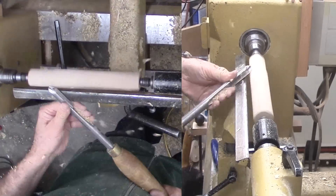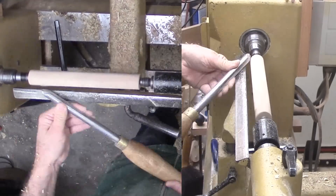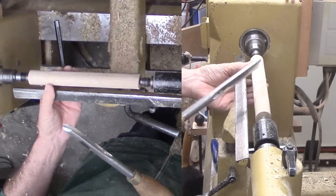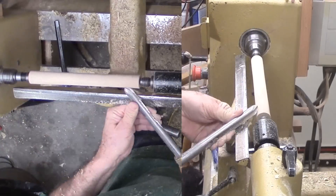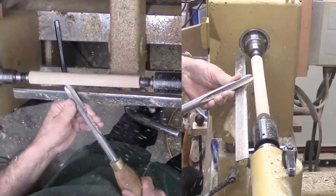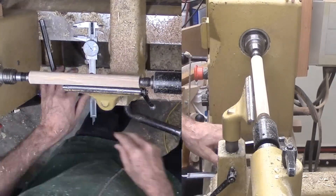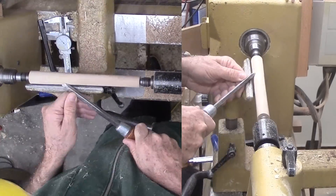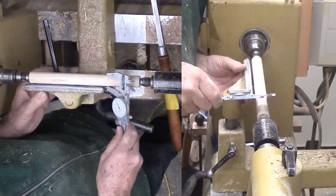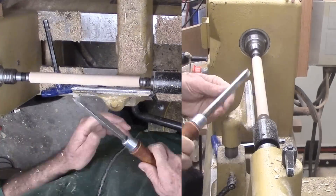Finally, I can start the heart. I am making the initial spindle longer than last time since I will be cutting it in half before hollowing it and then cutting the angle — I will not get the economy of a common cut. I'm roughing with my large bowl gouge. I can always use more skew practice. I'm aiming for about ¾ inch diameter, plus or minus. This time, no major catches. After sanding, I sawed it in half at the band saw.